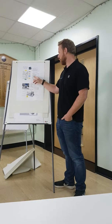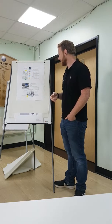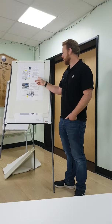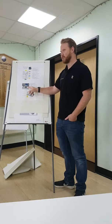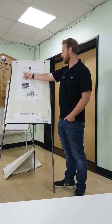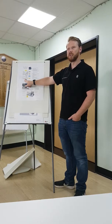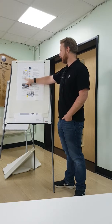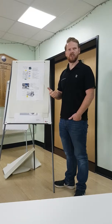There is complete product storage in the Kanban, but it's a walking distance away, which is a waste of time — a non-value-added activity. There's been some consideration for Kanban storage, but there's no way to store things that are actually being used at the desk. The finished product movement is also excessive. This process is fitted to around 75% of vehicles, meaning the associate is doing this activity between 20 and 30 times per shift — so up to 60 times a day — with all that associated waste and risk.